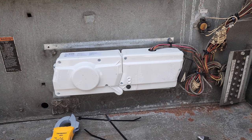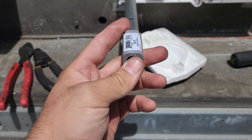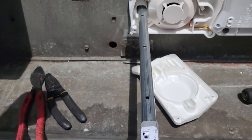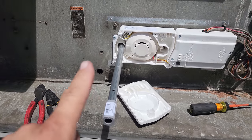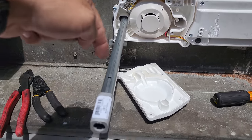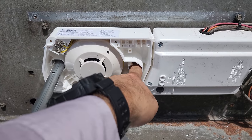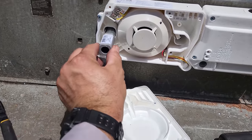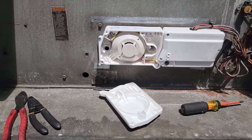As you're pushing in the sampling tube, it does have an arrow on it — you want to make sure it's pointing into the airstream. In this case, the air is forced down into this, and because we put a plug in the end of it, it can't go anywhere but out this port, through the detector head, and then back in through the exhaust port. You've got to make sure you get those in correctly.